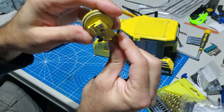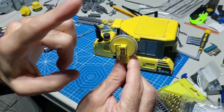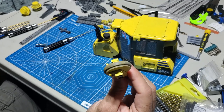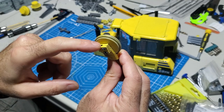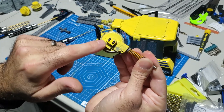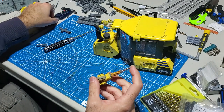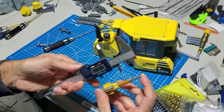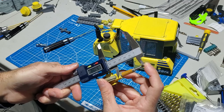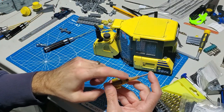The idler has two outside pieces where the track bracket goes. It's running on a three millimeter shaft and uses bearings - I believe they're three by six, or eight by three - so you need to get bearings for these. They are roller bearings so it rolls smoothly. You may have to do some light sanding to make sure it's all nice and smooth. This length here is about 50 to 55 millimeters, so cut it at 50 millimeters - you probably have a 100 millimeter piece you'll cut in half.